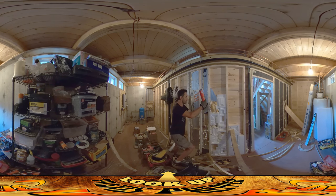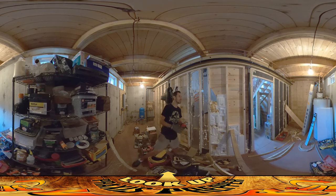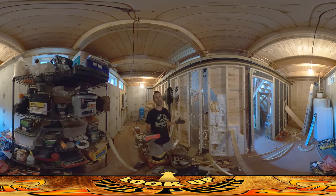Realistically there's not going to be that much of a temperature differential because this place is never going to get that cold — 50 degrees at the absolute minimum. So one inch of foam would be fine. But I've got all this scrap foam, it will give me some benefit, and I've got to use it up anyway or it's going to go to a landfill, so I might as well get some benefit out of it. Right here I'm putting a little bit thicker layer because this is right behind the refrigerator — the refrigerator is going to be venting heat out its back up this wall, so this area would tend to pick up more heat.